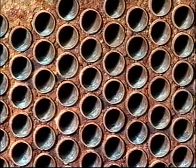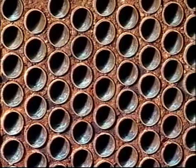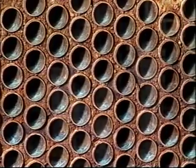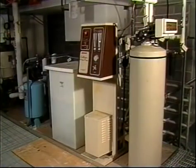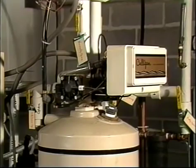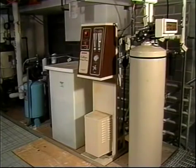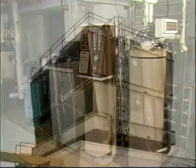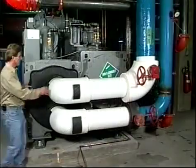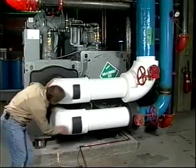Corrosion can produce pits that penetrate the tube walls, causing internal machine contamination and requiring replacement of some or all the tubes. A water treatment specialist should be consulted to determine the proper treatment for local conditions and to set up a treatment program. It's extremely important to carry out all maintenance requirements for the water treatment and for the cooling tower itself. Even if you contract out the majority of maintenance work, you still need to understand what it is that needs to be done.